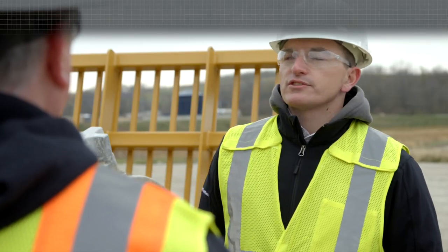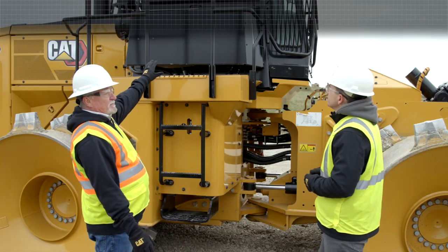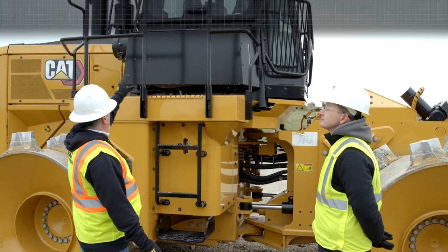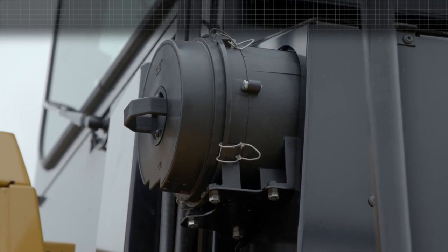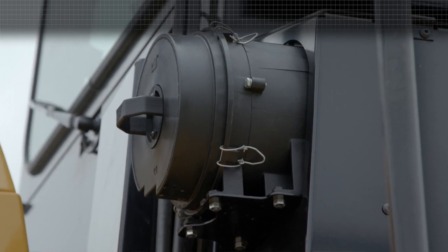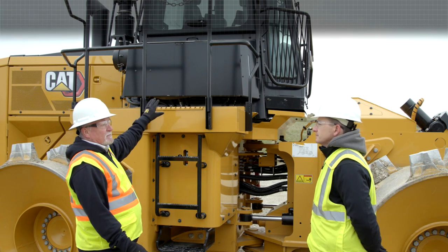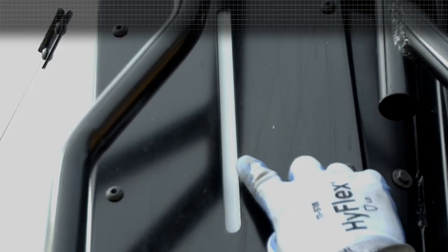Are there any other areas we should discuss on the side of the machine? You can see up here on top, the platform on the side of the cab — we have our HVAC system all on the outside. We have a turbine pre-cleaner that actually spins clean the material, or the dust coming in from the environment, pre-filters it, and then runs it through another standard filter and pressurizes the cab. All of that is easily accessible right through this little case up on top, and the windshield wiper fluid is also up there with a sight gauge exposed.